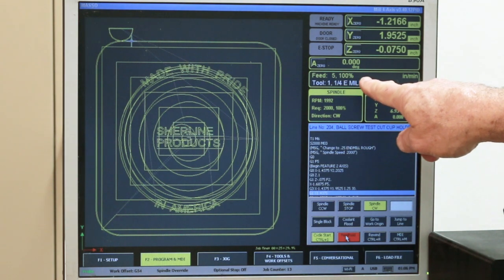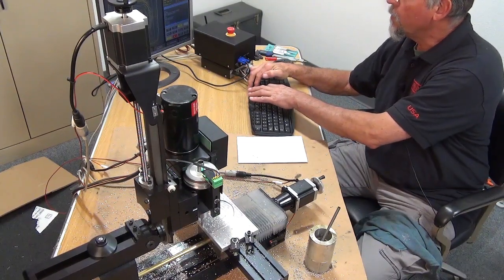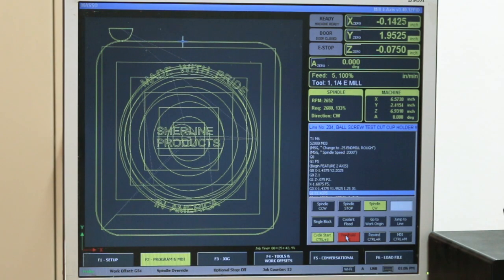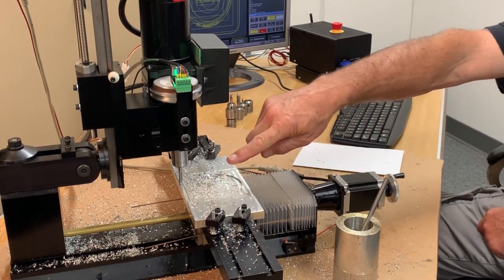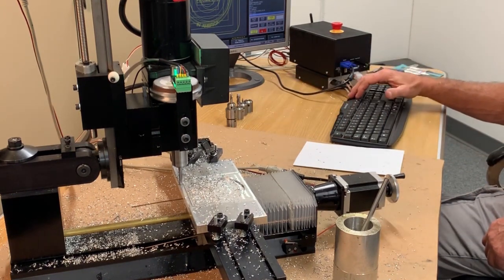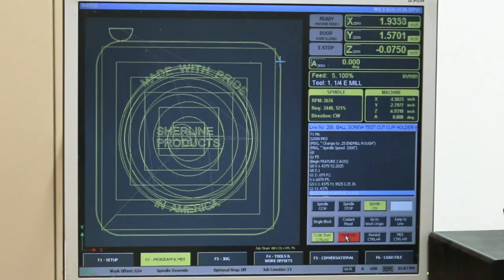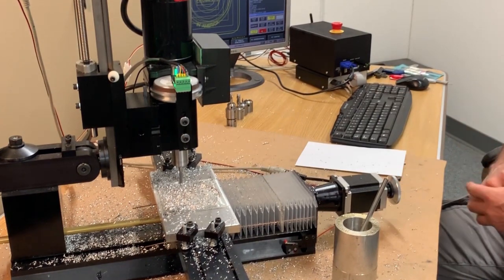The spindle speed is at 100%. If I press S12 and the plus button, I'm at 133% now, and the RPMs just went up to 2,800. Right now it's taking about two-thirds of the cutter width on the groove. When it comes across it'll be a full width, so because of the increased RPM we'll start to get some chatter. If I have chatter, what I can do is start dropping my RPMs. Right now I'm at 105% — it cuts a little heavier but there's no chatter.